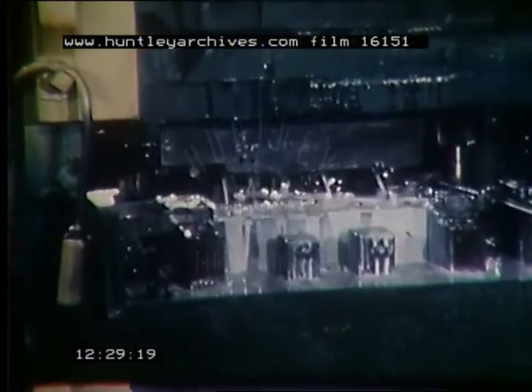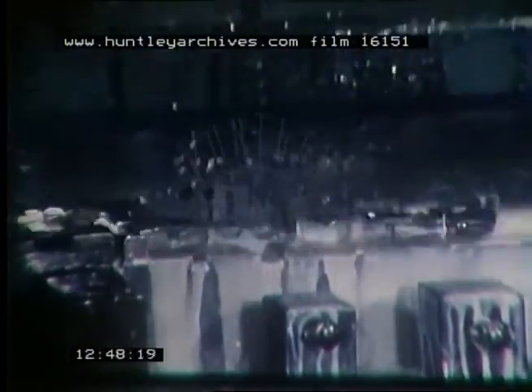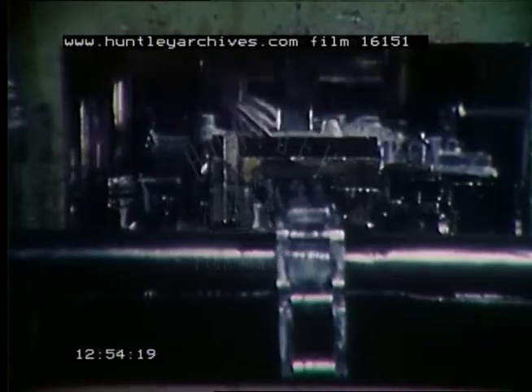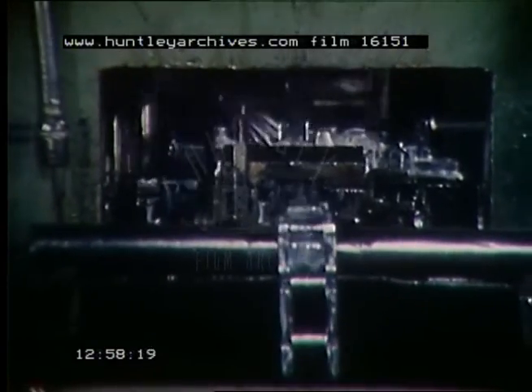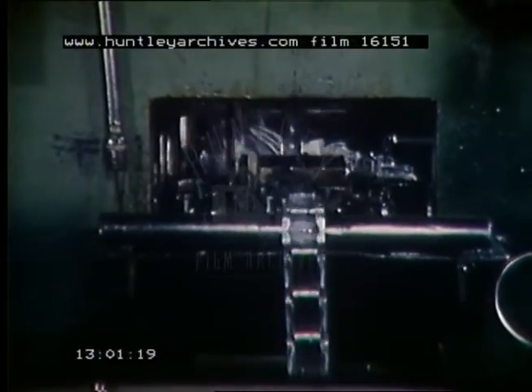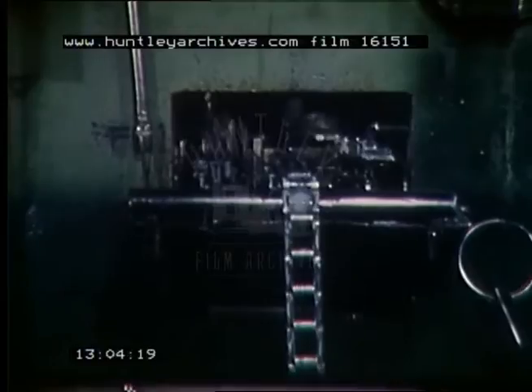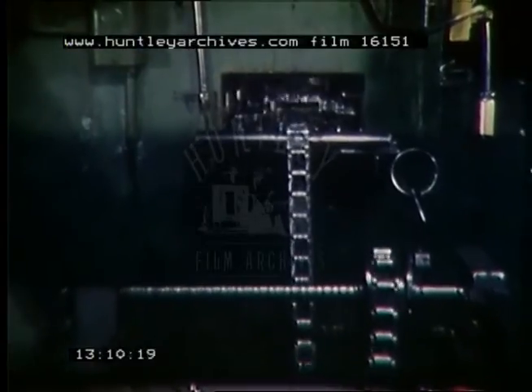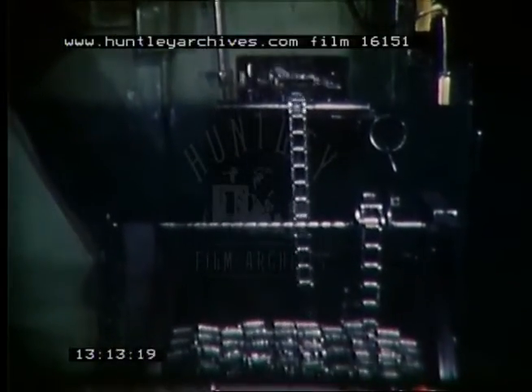No material is being scrapped in any of the operations. Watch the work piece move progressively in the die. Your attention is directed to the reverse motion of the material at the last station just before the lance is being curled around the pin of the partially fabricated link following it. As each link is formed, it advances and the chain is wound automatically on the spool. The operation is entirely automatic, forming 72 links or approximately seven feet of assembled chain every minute. The finished chain is then heat treated, water quenched, and drawn, after which it is tested for strength of 4,000 pounds.